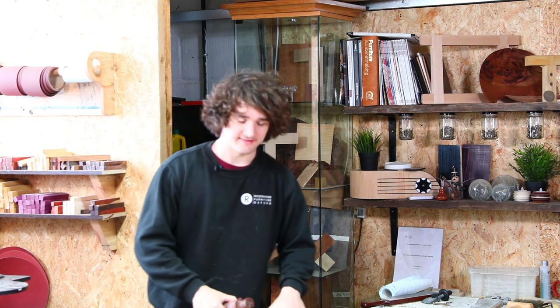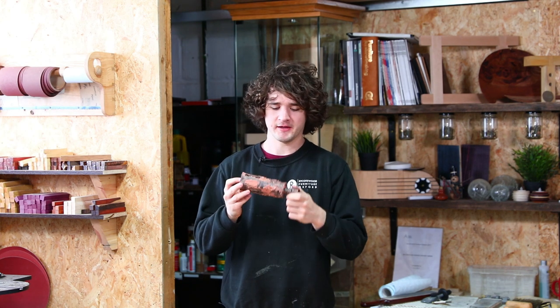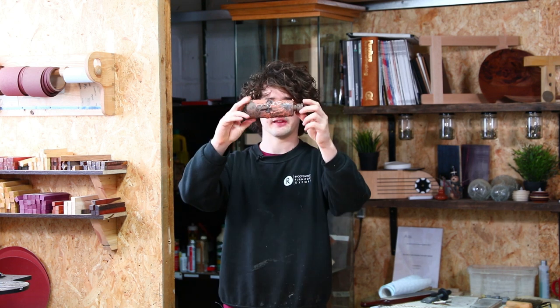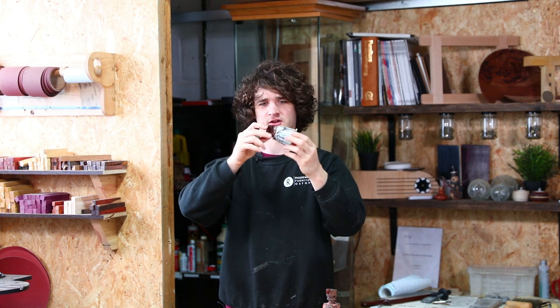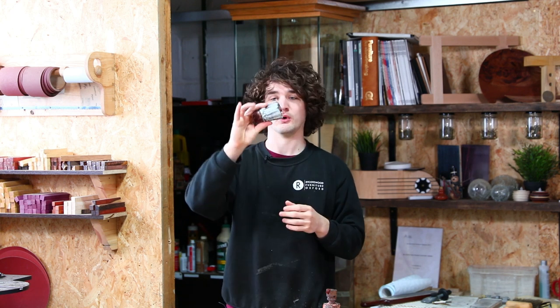Okay, so it's now a couple of days later and I'm starting to think that I've done a little bit of a silly here. I have coated them in another layer of epoxy to fill out any of those other voids that were left over after the initial coat, but I'm starting to realize now that perhaps I should have drilled the internal holes and the tenons and everything before shaping the outside of this, because this tapered thingy, specifically these ones actually, are going to be very difficult to hold in a chuck while drilling the set. Well, it's not going to be difficult, it's just going to be awkward and it's going to leave jaw marks left over on the finished piece, I suppose. So yeah, if I was to remake these, then I would turn all the internal gubbins before shaping the outside.